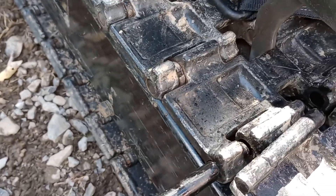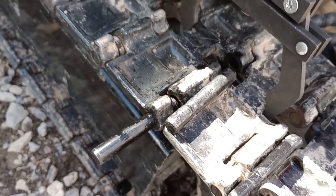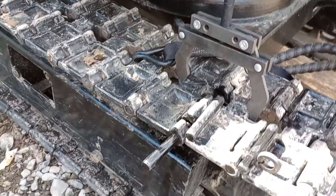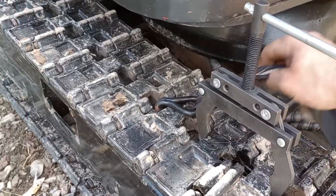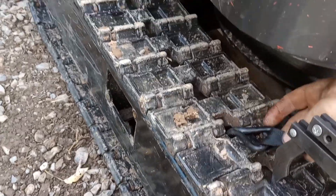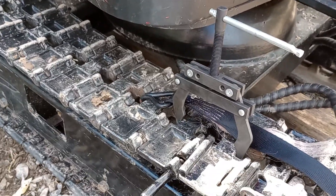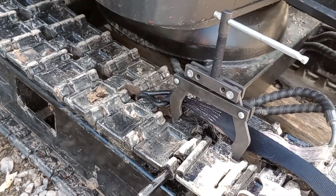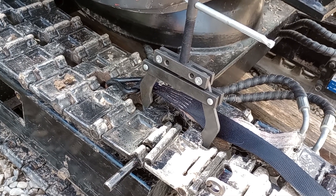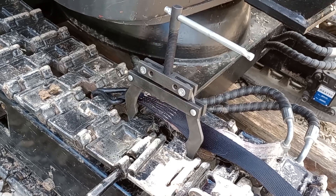And then the same thing for this side. You'll need a punch and a hammer to do so. A little bit of WD-40 couldn't hurt during this job. And if you use an old ratchet strap, you can hook into the tracks like so and pull these tracks around, pull them in position, keeping your fingers back away from the track link so you don't pinch your fingers. Hopefully I can show you how this works out here in a little bit. Talk to you later.